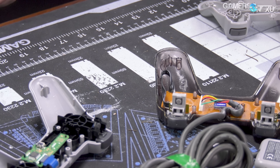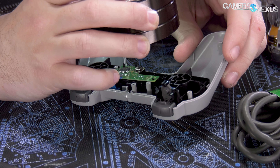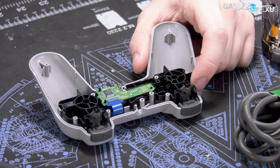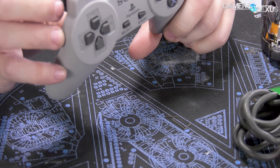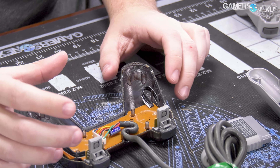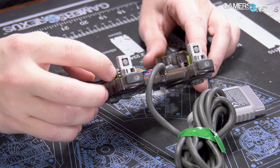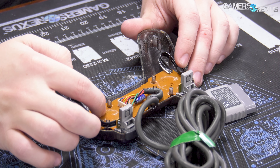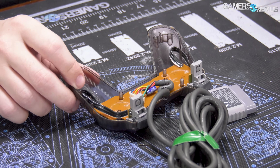For this PCB, the IC is marked IOKBC 830AZ0B, revision A01 — it's a controller IC, literally the processor of the input, not a handheld game controller. There's a ribbon cable here attaching to probably another small PCB. The USB cable is easily replaceable, which is really nice. Meanwhile on the old one, it's just a bunch of PCBs with cables running around the whole outer edge, connecting as an interconnect to the trigger buttons. I'd be curious what the latency difference is between button presses on new and old — it's probably unnoticeable, but I'd be curious to see if it's measurable.